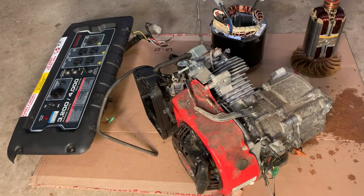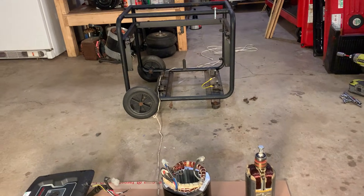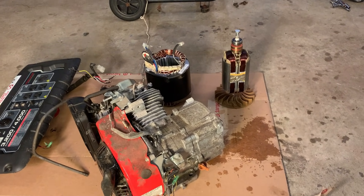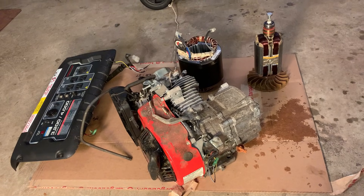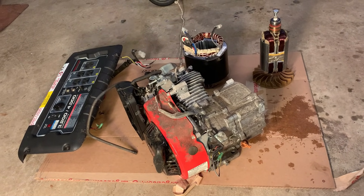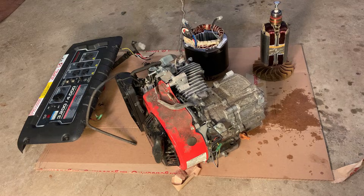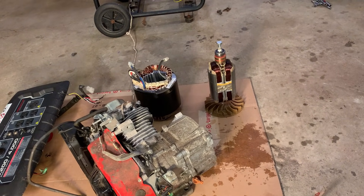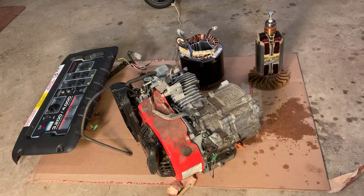Not too bad for 50 bucks — we got a good Predator engine, the control panel, a good stator, what's left of the frame, and a fuel tank. Potentially this could be fixed if I could buy a new rotor, but generally it's cost-prohibitive, and in the case of Predator I can't even find a parts diagram, never mind parts for the generator. The engine has plenty of aftermarket stuff and it's just a Honda clone, so most likely Honda stuff would fit. I just wanted to show you how to troubleshoot a no-power situation, and in this case it's terminal. Now you know how to break down a Predator — hope this video helps someone, thanks for watching.